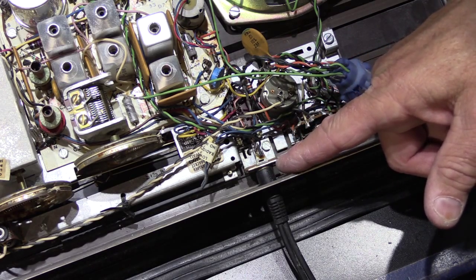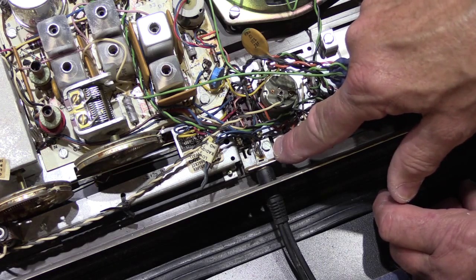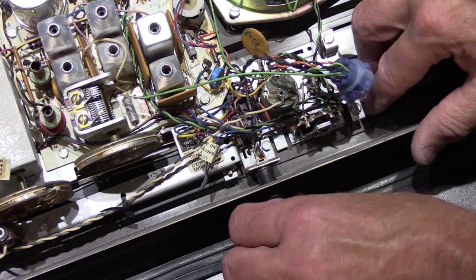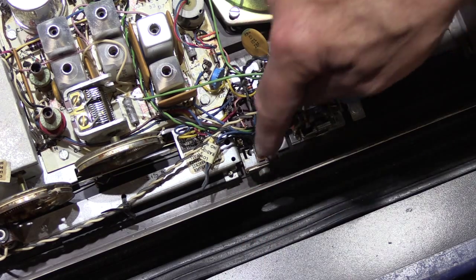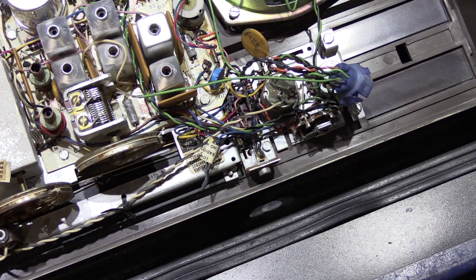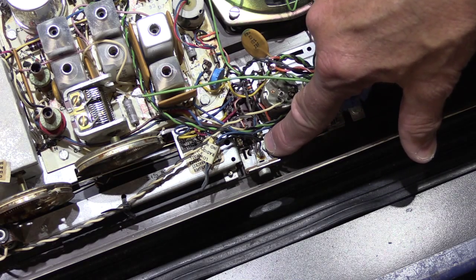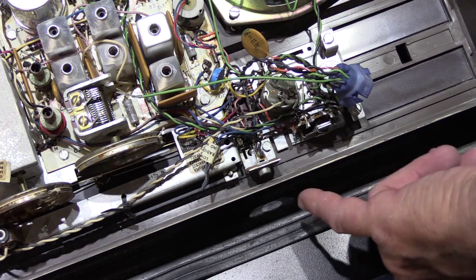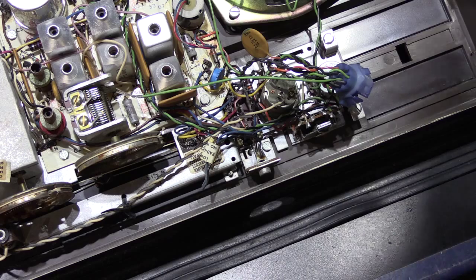That's the standard connection. Fortunately, NuTone was smart and clever about how these kinds of sets were designed, and this RCA socket is movable. So as it is right now, and this is the original factory default way that this would have come out of the box, this can be relocated so you can use it internally and not have to pass a cable through the hole in the faceplate. So now I'm going to show you how to do that.